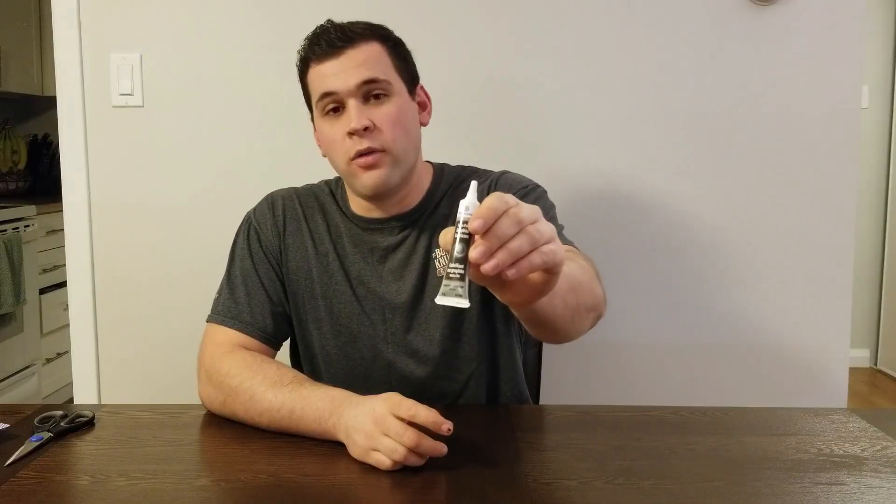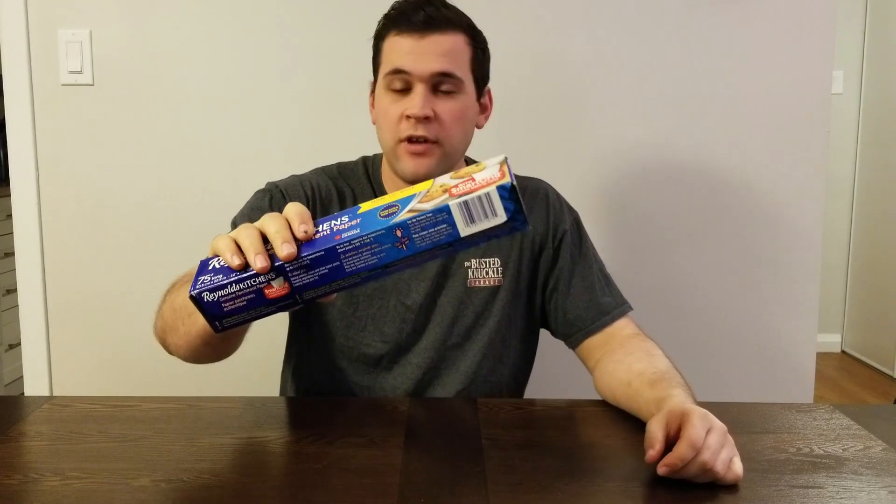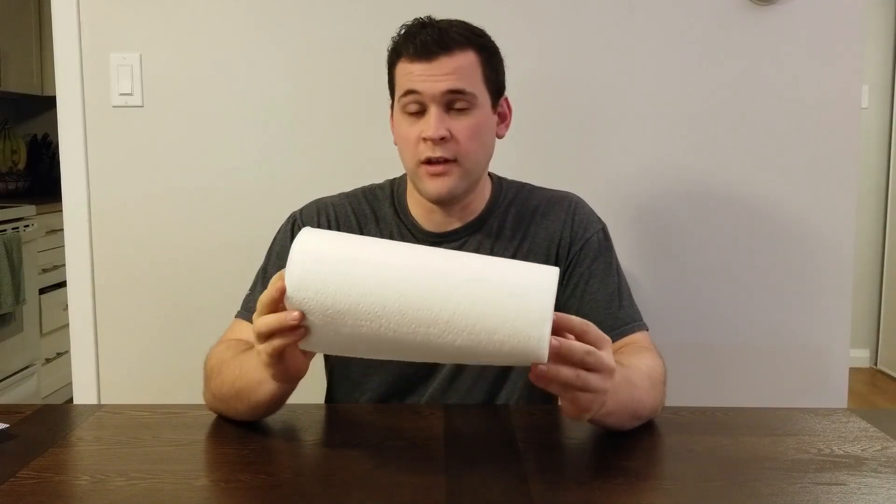What exactly do I need to have to do that? First, I need a source of carbon for the cathode — I chose to go with powdered graphite. I'm going to use some paint to mix with the graphite powder so it doesn't get everywhere and I can easily apply it. Next, I need some aluminum for the anode — I went with some good old-fashioned aluminum foil. Some salt water to act as my electrolyte, some copper mesh to conduct everything, some parchment paper to act as a separator between the battery cells, some scissors to cut everything up with, a deck of playing cards to keep everything in uniform shape, and some paper towel to hold the electrolyte and the cathode. And of course, this would not be a proper project without duct tape to hold everything together.